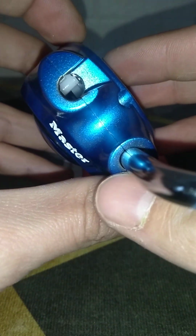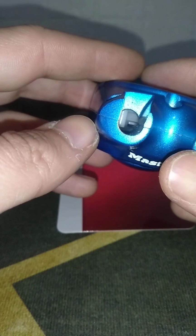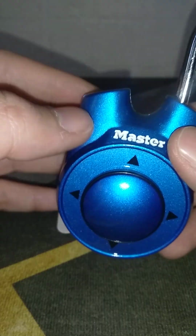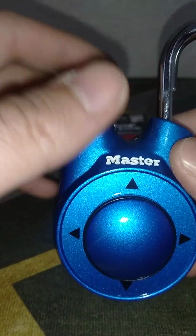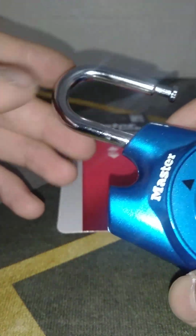It doesn't open with ease, which is pretty bad. As you see, it's a complicated mechanism full of plastic parts. It smells. It's a bit oiled, factory oiled. So if you want to oil this lock, you should probably use sewing machine oil, because if you use something like grease, you will jam the lock permanently, and you couldn't use it anymore.